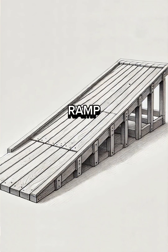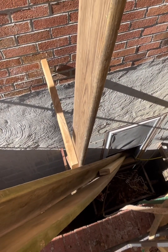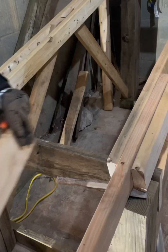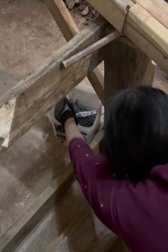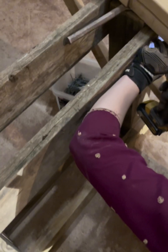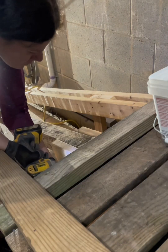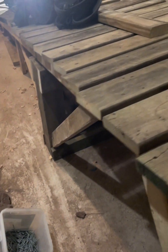Now for the mine cart ramp. I need a lot of lumber for the ramp and these two side rails make it a breeze to get it down into the basement quickly. I'm building the ramp to allow a powered mine cart to get up to the window so I can dump directly into the hopper — it is a huge waste of effort to dump rock on the ground and shovel it out the window like coal into a furnace. I am building it extra heavy with 6x6 legs so it will not tip over and will last a long time. The steepest incline I feel safe with is about 33%. And now it is done and ready for use.